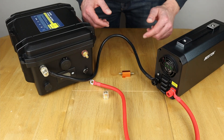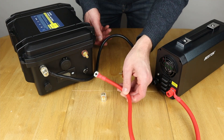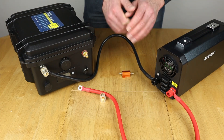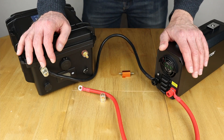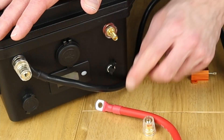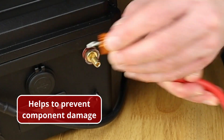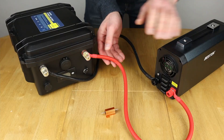Before hooking up to the positive terminal I wanted to cover a couple of things. The replacement cables I've got are 25mm² cables — nice copper cable I've shown in previous videos. They come pre-made with lugs already attached so you can just plug them straight in. I'm not going to be using a circuit breaker in this case because the Beztek already has built-in fuses. Also, once you hook the battery up to the inverter there will be a sudden inrush as it charges the capacitors, which usually creates a spark. To prevent that, I've got this resistor — I hold that on there to make that connection and stop the spark, then pull it off, connect properly, and screw it on tight. And the inverter is attached.